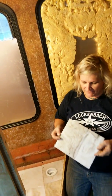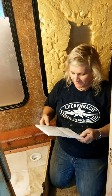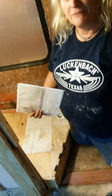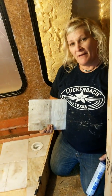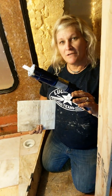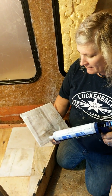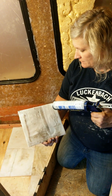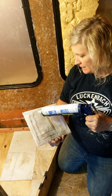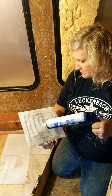When we're done we have a tile that looks similar to this. You could clean it up and make it look all pretty and exactly the same color, but I think that kind of takes away from the look of it, so we're going to use this one just the way it is. I tried a couple of different waterproofing membranes and none of them seemed to work, so I went back to something I've used for years — silicone, 100% silicone. What could be more waterproof than that? So what we're doing today is lining the whole back of this tile with silicone.